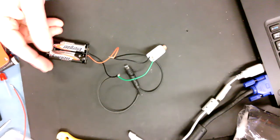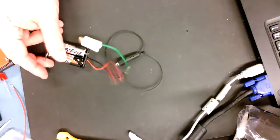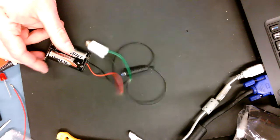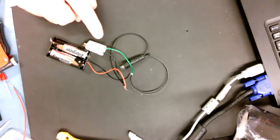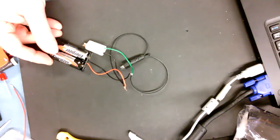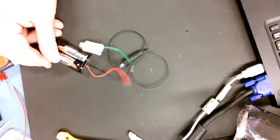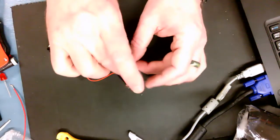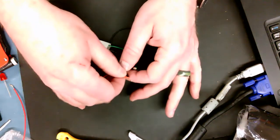And so if I flip the switch, you're going to see that the motor starts to vibrate, it bounces around. But you're also going to see that the lamp doesn't turn on as brightly as before. And that's because now we're keeping the voltage high, but we're splitting the current. We can't use as much current.